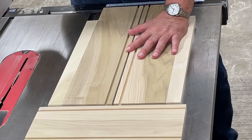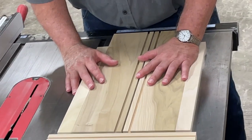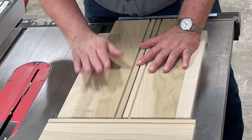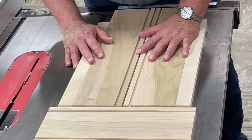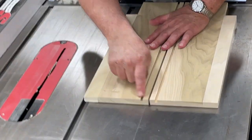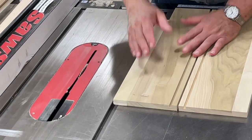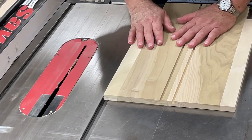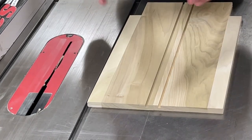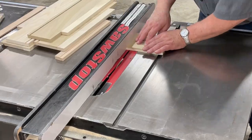And that may be my own experience. That's just what I've experienced in the course of doing drawers, that the Baltic birch on a butt joint is just a great joint, but whenever I do a solid wood drawer, I need a little extra holding power, and so we're going to create a little rabbet joint. So just watch as I get through. What I'm going to do is I'm going to make a small kerf cut. I'm going to take out a little of the material to create, and then we're going to cut the front and back of the rollout to match the thickness that I need, or the width I need to make the drawer. Long explanation for a short process. Let's get started.